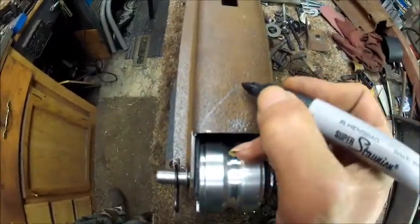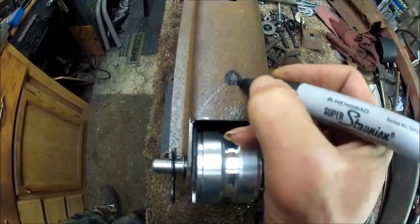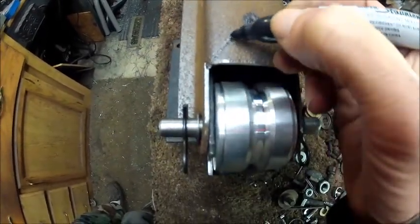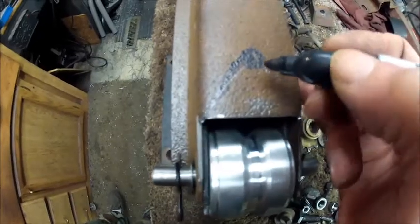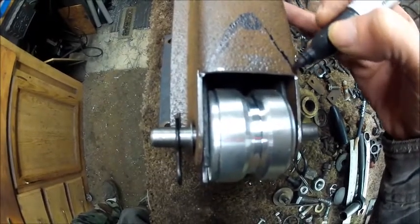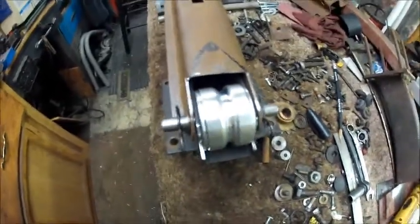What I'll do is drill a hole right here, about half inch. Then once we've got our hole drilled, we'll just take and cut from this corner to the edge of that hole. That will give you a nice round contour right there for the cable to go through. Then we'll come back down here and cut this part to this corner, and then just take a file and make it look nice. So there's the idea on how we're going to do this.